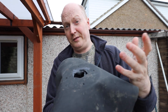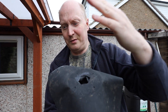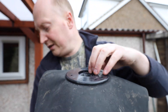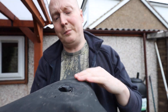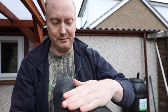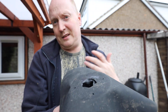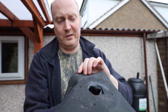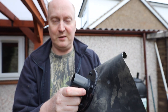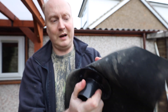I didn't elect to put any on the top - you can do both if you want. Some professionals just want to save silicon and think you don't need to put it on the top. People who want to be more secure about having a strong seal will put silicon on the top - it's completely personal preference really. I've seen people in America that don't do that and I've seen UK people that do. So we're deconstructing this flange tank connector - it's a 1.5 inch variant with four screws.